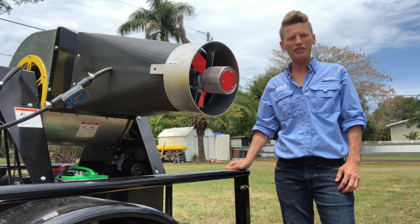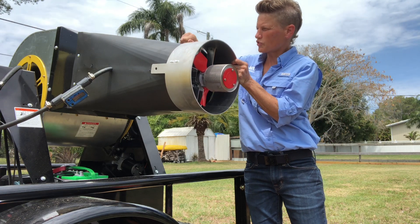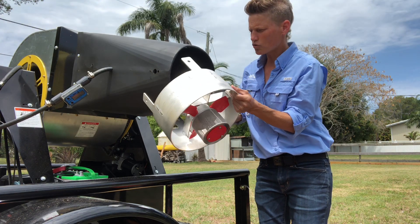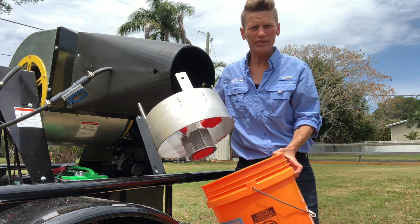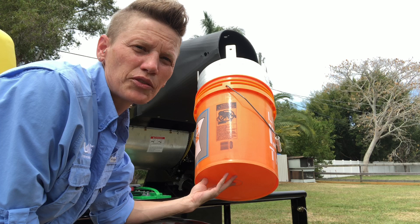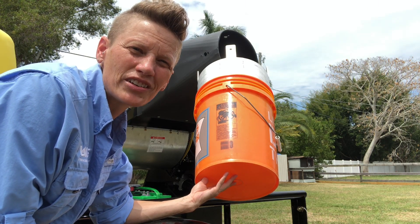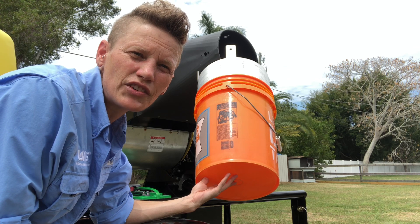Now that you have the flow meter set to your desired flow rate, remove the Micronair head from the boom by removing all four screws. You'll have a little bit of leeway in the hose where you can turn the Micronair just outside of the airflow. Then place a five-gallon bucket just underneath the Micronair head to catch the material coming out. We're going to turn on the equipment, throttle it all the way to full throttle, and turn the spray on for one minute, collecting all the material in the bucket. After the one minute, we'll measure the amount of material and ensure that our desired flow rate is achieved and the flow meter is accurate.